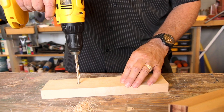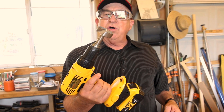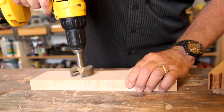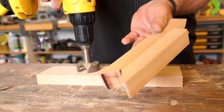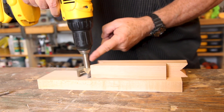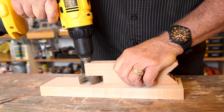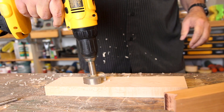Let's just put that in there and see what you get as far as perpendicularity. Look at there. But now when you go to use Forstner type bits, there's another problem. If I put this and I encounter the starting point, and I want to make sure I'm not rocking around, using that end is going to do no good — where I need to guide is the shaft. So what I'm going to do is rotate that around, pull it up there, make sure I'm in against it, and as you can see, I can go straight down and not have a problem.